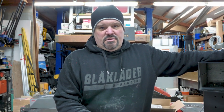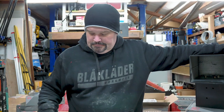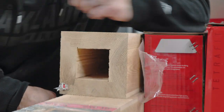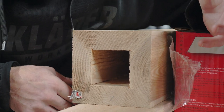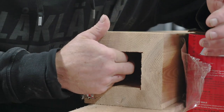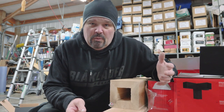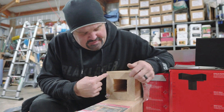We're going to start laying one out, getting them out of their boxes, and following the directions — steps one through fifteen. Here is the end of one of the Sticks posts you can purchase straight from a Wild Hog dealer. You can see how they cut the rabbet into the miter instead of just a plain miter. They're kiln dried structural posts with a hollow core, so you can actually run wires or lighting up through them. They're a little lighter and easier to handle than a traditional six by six, and they're high quality — nice and dry. I just wanted to show you the glue joint on the end and the hollowness of the post.